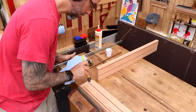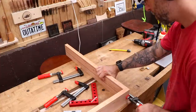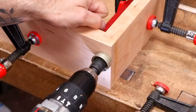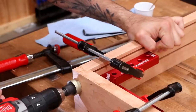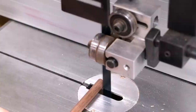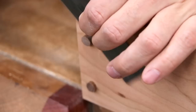The other side of the frame gets a permanent connection. I'll glue and clamp the joint closed. Rigid clamping squares are super helpful for a glue-up like this. Once the glue is set up, I'll reinforce the joints using screws — you could also use dowels here. If you're in a rush, you can forego the clamps and just use the screws from the get-go; just make sure the pieces stay nice and square. To cap off the screws, I'll cut some walnut dowel stock into little nubs. After the glue dries, I can use a flush trim saw to cut them off.